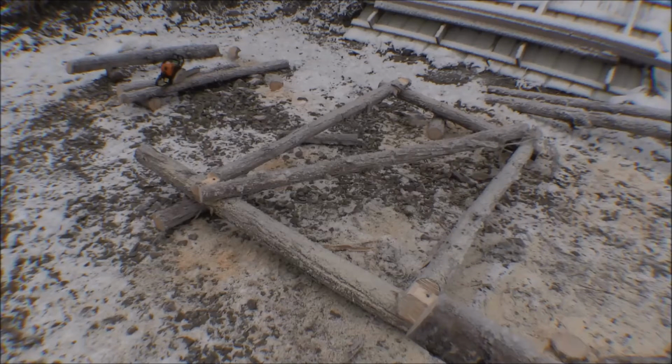It's probably within an inch, maybe less. Now I got a small piece there that I'm going to put in as a diagonal. I'm going to go ahead and cut the angle there so it butts up against both that top board pole and the bottom one, and fit it in and screw it down. Then I'll go ahead and put some more screws in some of those joints so it doesn't rack anymore after that. With this diagonal in here, that should hold it pretty stiff.